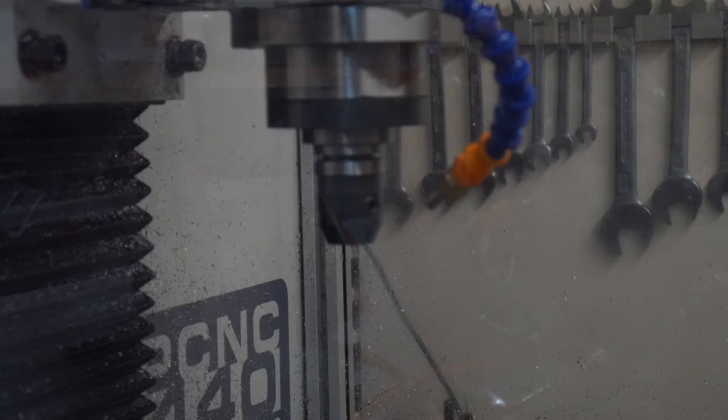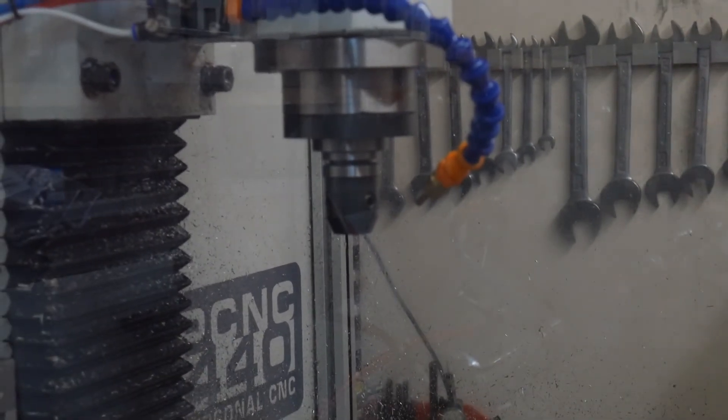That's pretty good for a mill that's not supposed to be able to reverse its spindle. Now, you may know Mach 3 doesn't support canned tapping cycles, and I use Fusion 360, which bizarrely doesn't support expanding them. So I had to change the post a little bit myself.